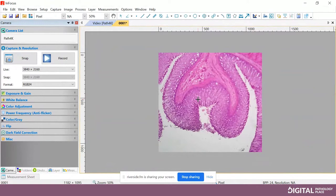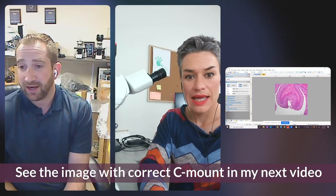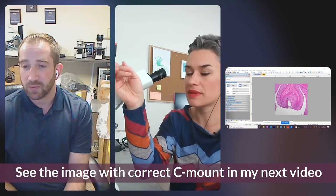Let's keep going because then I can show the vignetting, and when I put the right C-mount in we can show the correct result. This is important information because it happens with every camera. A knowledgeable sales rep would identify the right C-mount and provide it with the camera. In this case, we sent you the camera for evaluation and you had already bought the C-mount — that's where the disconnect is. We're happy to send you the proper 0.7x one; I'll get that sent out to you today.